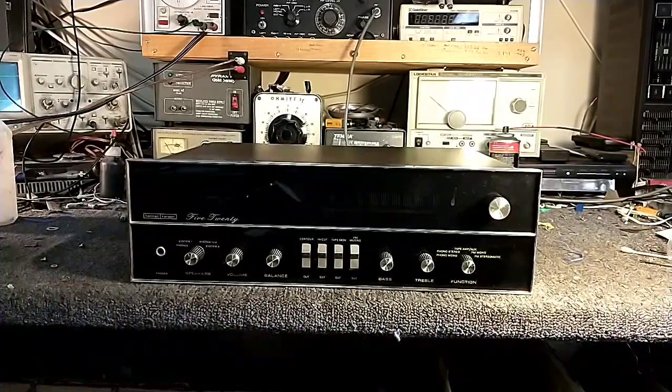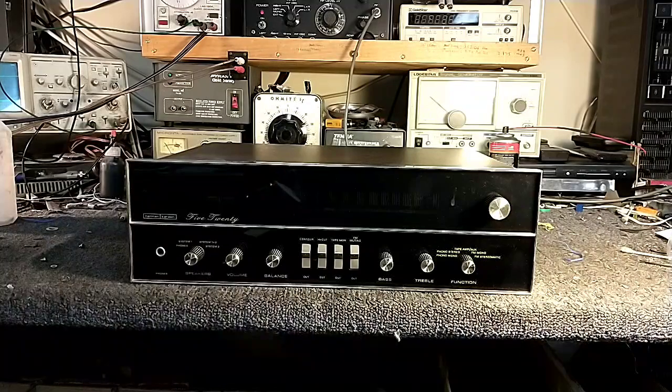Hey YouTube, it's JP Dillon. Today we're going to look at a unique cool piece - a 1969 Harman Kardon model 520, spelled out, which is different than the 520 ABR listed on Google. These were a very entry-level to moderate-level stereo hi-fi system, about 20 watts per channel, although given the heat sinking I'm not sure it would actually sustain that. This belongs to a longtime customer - it's been in his family a long time. He recently inherited it, flipped the switch, did the smoke test, and it failed the smoke test. So we need to figure out what went wrong, if it is repairable, and what other things it may need along the way.